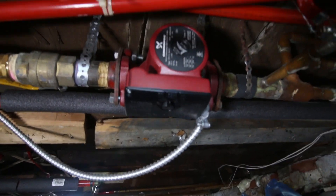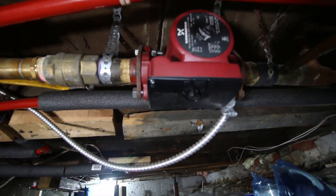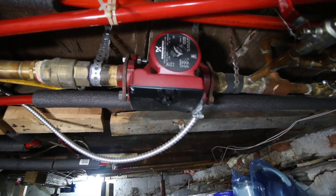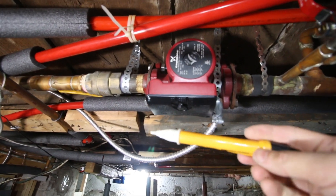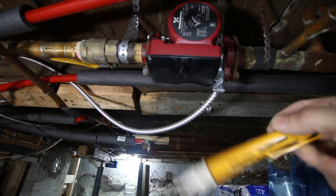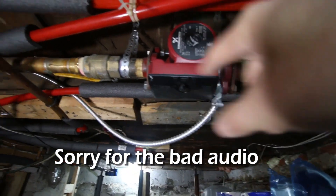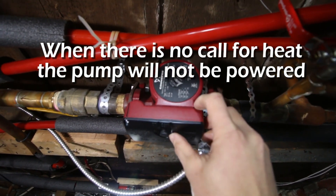This guy right here isn't working, so I'm going to swap this one out. I'll show you how I was able to figure it out. Besides just listening to it, I also need to know if the boiler was working properly with electricity going to it. The way I do that is I use a non-contact voltage meter — I have two of them. When I hold it up, I see the red light flashing, so I know I am getting electricity through the line into the pump. I know the pump is bad because it's not circulating.